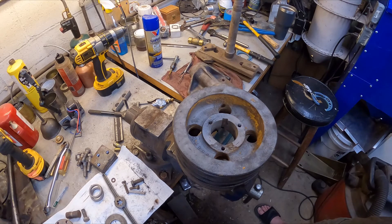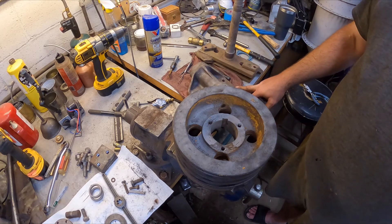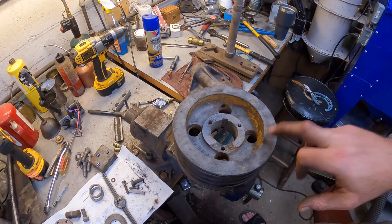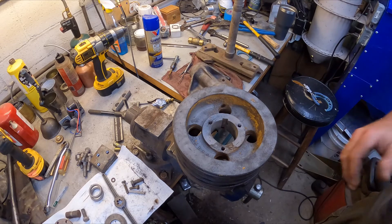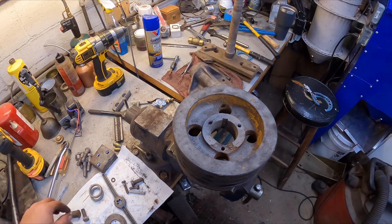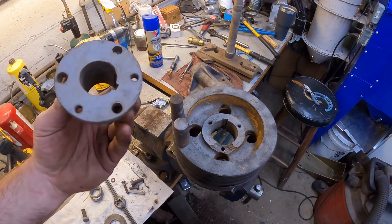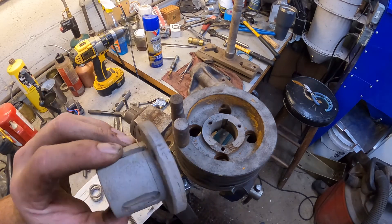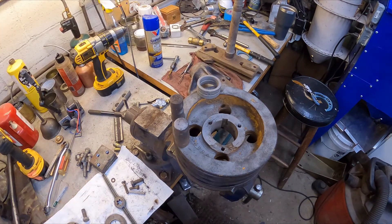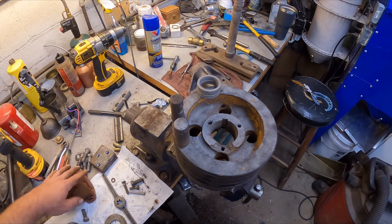Next we're probably going to go ahead and paint these up real quick. I don't know what paint I have over there but it doesn't matter much since you won't see it - only the top of the pulley shows. If I have yellow or orange I'll use that, but if I only have purple that's what's going on it - at least it'll give it some protection. After that we'll probably work on either these pins or this housing piece - it's not too bad, just needs some filing. Then there's these rings where the seal's supposed to ride - I'm afraid that rough surface would rip a new seal right away. Let me get to it and I'll bring you back.